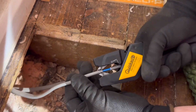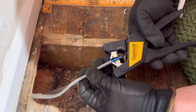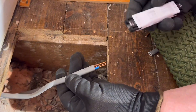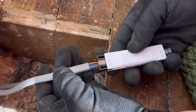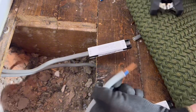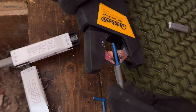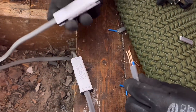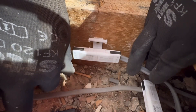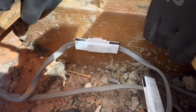So I'm using the Quickwire cable stripper which has a guide on here to strip the cable to 22mm, and once the outer insulation is off you then line up these end clamps with the inner insulation to strip back to the conductors. Now it's really important that you do not spread the wires, because you don't need to - it is stripped to the perfect length and the cable will literally just click into place and then it's done. As quick as that. So I connected the other leg of the ring, which was just as easy, and I also fixed the one back to the joists as well.